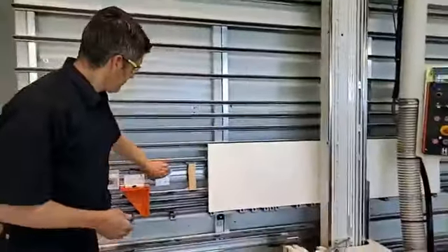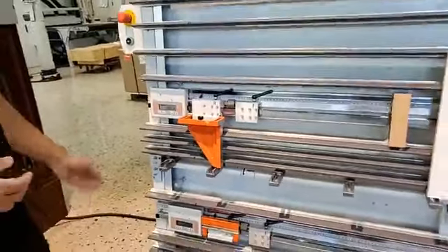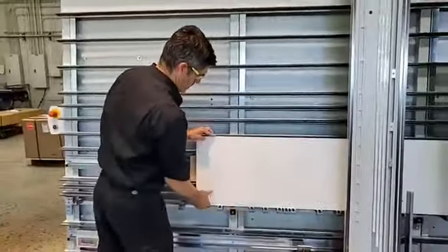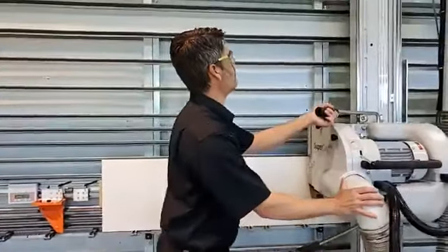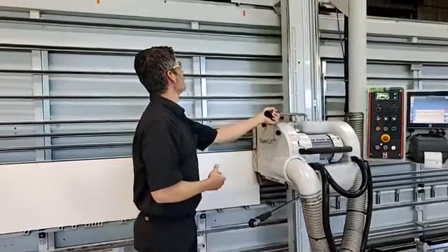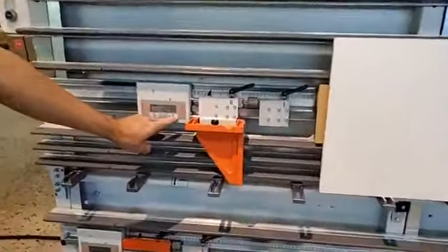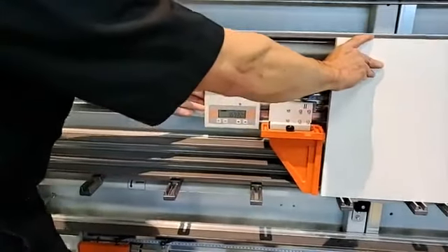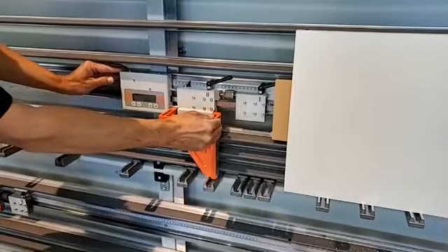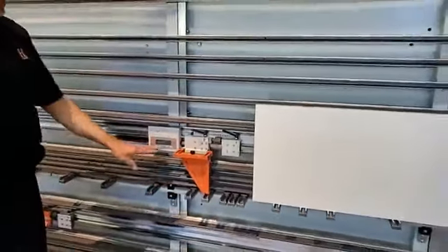Now as Christian can see, my scale only goes to 1086mm. If I want a larger part than this — let's say I want a 1200mm part — I'll unlock the saw and go to the next cut station. On the scale I'll press the button for the next station, which is station 3, and now it automatically adds the distance. So now 1200mm to the blade. So now we have a 1200mm cut.